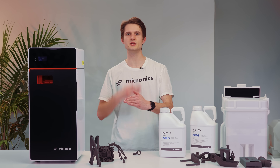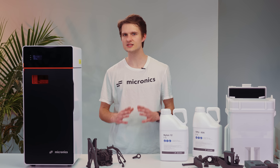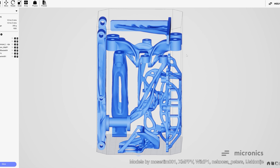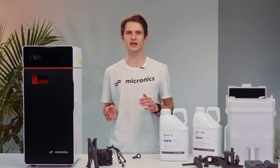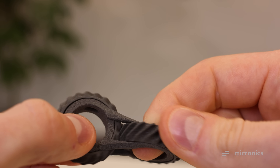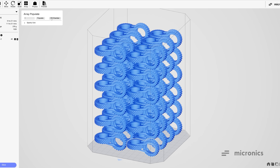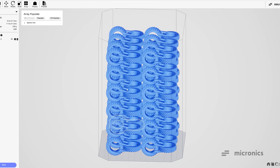This process is then repeated until you have your parts. One of the major advantages of SLS is that there is no need for support structures, since the layers are supported by unfused powder from the previous layers. Therefore, whatever you are able to design in CAD — whether that's interlocking mechanisms or large unsupported features — it can be printed out. Also, since you can basically print in mid-air, parts can be placed on top of each other, making for full use of the build volume.